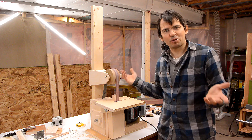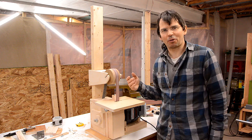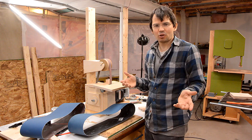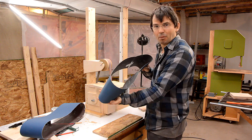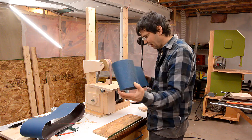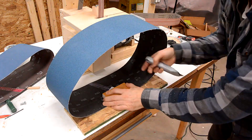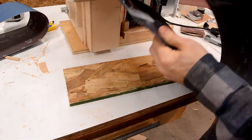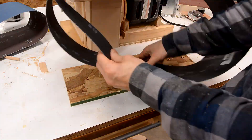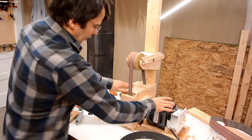So didn't I just build a strip sander when I meant to build a belt grinder? Well, it works as both. I couldn't find any 2-by-72-inch grinding belts locally, so I bought some 6-by-48 metal cutting belts from Busy Bee Tools, and I'll just cut myself a 2-inch belt off one of those.